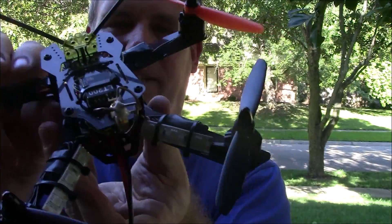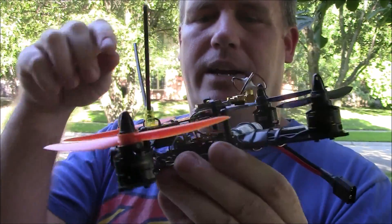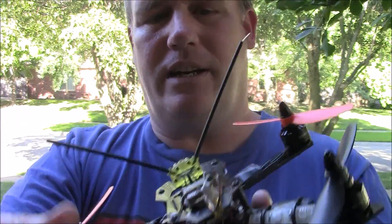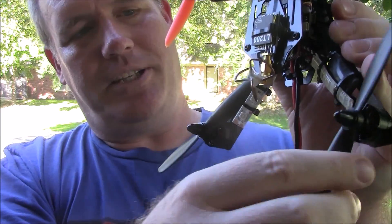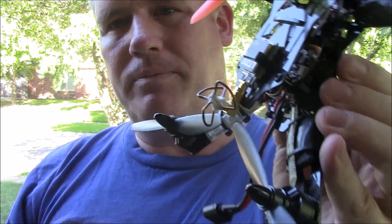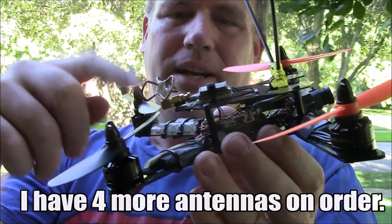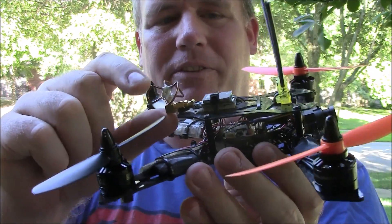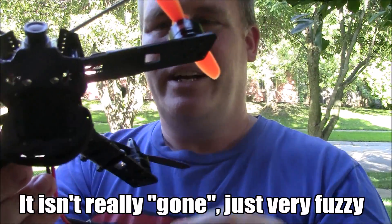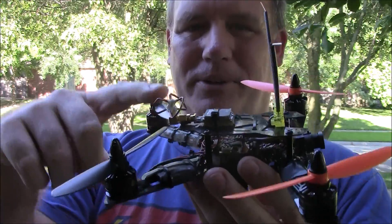I attached a couple of LED strips onto the rear arms for FPV flying with friends so they could see the quadcopter better in their video. I was originally planning to put the video transmitter on the bottom side, but the propellers spin too close and there wasn't enough room for the antenna without it getting hit. So I moved the video transmitter up to the top. The short stub antenna doesn't work well — whenever it points away from your goggles you lose all video, and if it faces you and the goggles can't see the antenna, you lose video too. You really want the one with the longer stand.